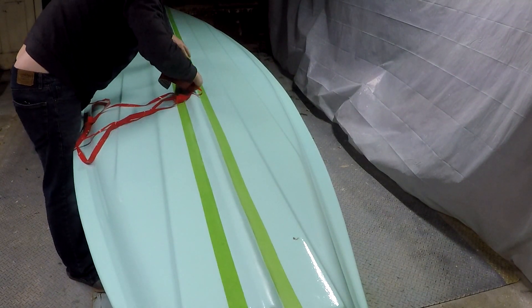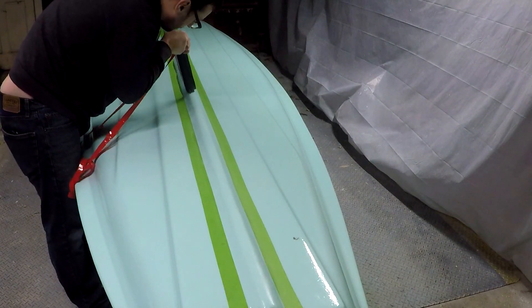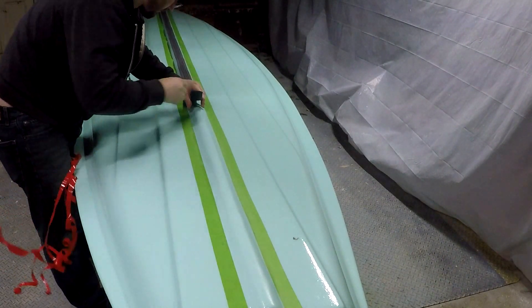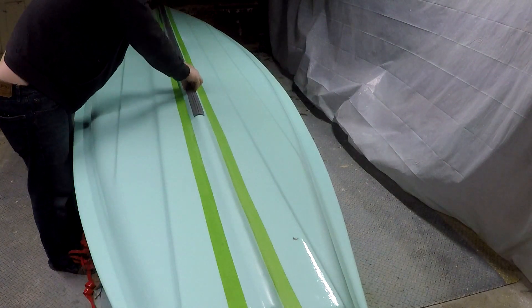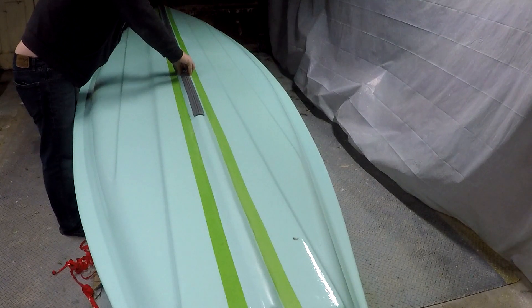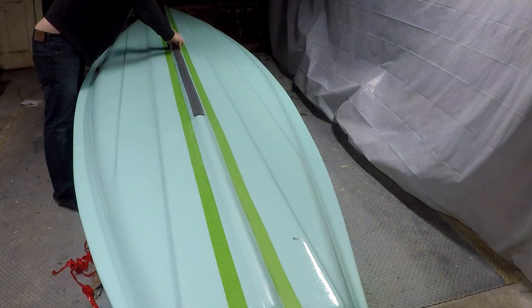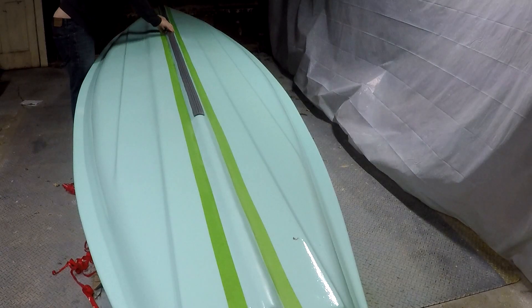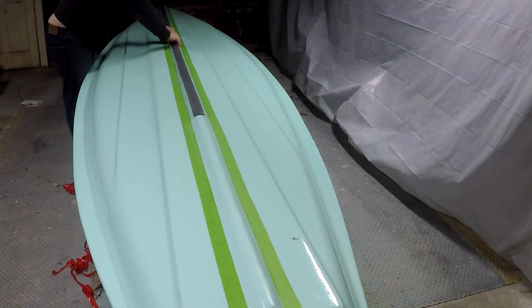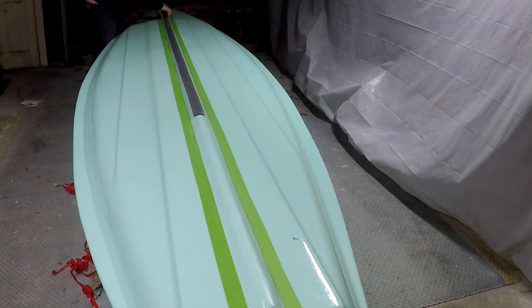As you can see, there are three pieces of tape and they are scored — one for the middle and two for the sides. That way, on the larger piece, you can get the middle piece centered first, then pull away the sides to make sure everything is lined up. They offer keel guards in many various sizes. This is the charcoal color — I felt the charcoal would look really good with that seafoam green. Since I did go ahead and etch and prime that whole bottom, I can get a shorter piece of keel guard, trim it down, and attach it on the full length of the keel. Here I'm just pressing in the edges and the middle to make sure everything is nice and seated.